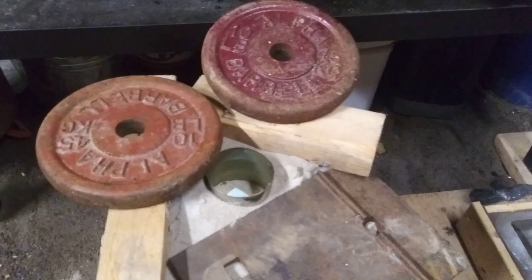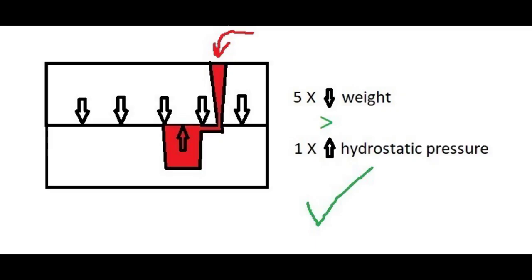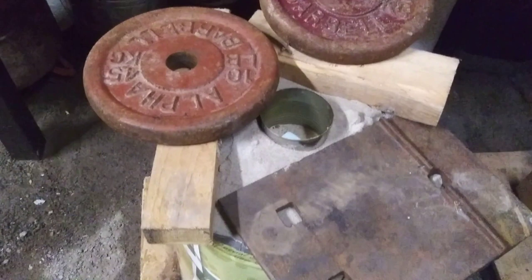This time, since I've been casting it in bronze again — even though it's not as wide as a full bunny rabbit body, which would make it more prone to sand float like we saw last time — I used a taller bucket and buried it deeper. I used my reciprocating saw to vibrate the bucket properly instead of just tapping on it like usual, and I put weights on the sand. That should all help prevent it from floating this time.